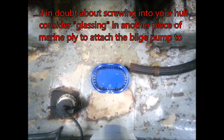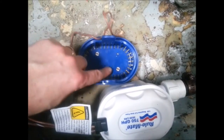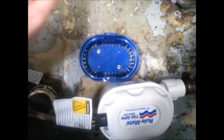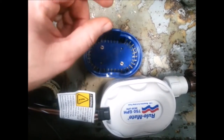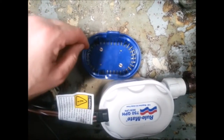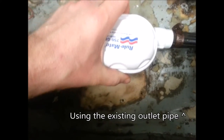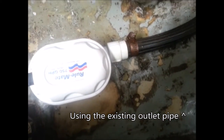For cleaning, this blue part of the bilge pump tray - I've put two substantial screws in and it's bolted onto the bottom of the bilge. They're about that deep screwed into the hull. So now this slots on and can be taken off for cleaning - just clips in like that. I've kept the old jubilee clip; after a bit of a clean there's nothing wrong with it, just a bit of surface rust. So it's down there now, sat on.